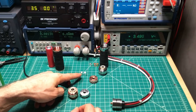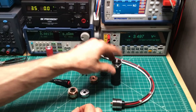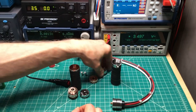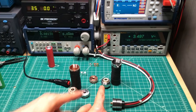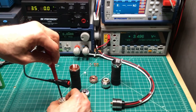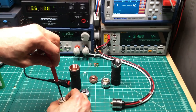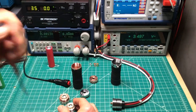What I'm going to do now is take two waffle pins — that's the stock pin — and I want to swap buttons. Measure copper with a copper button, stainless steel with a stainless steel button, and then swap buttons to see how that affects voltage drops. Let's reassemble and start from scratch and measure the performance of each.